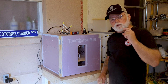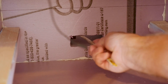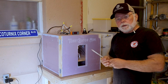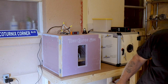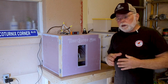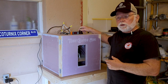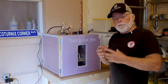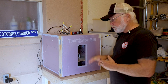We need to open up the lower air intake for the forced air chamber. Right now it measures one inch by about four inches wide. We need to make that an inch and a half by four inches wide. I just took a hacksaw blade and cut on both sides of the current opening, about a half an inch taller than it was before, then cut across to take that piece out. The reason we have to open up that heat chamber is because ceramic heaters run a little bit hotter than a light bulb and hold heat longer, so we need a little bit more air circulation.